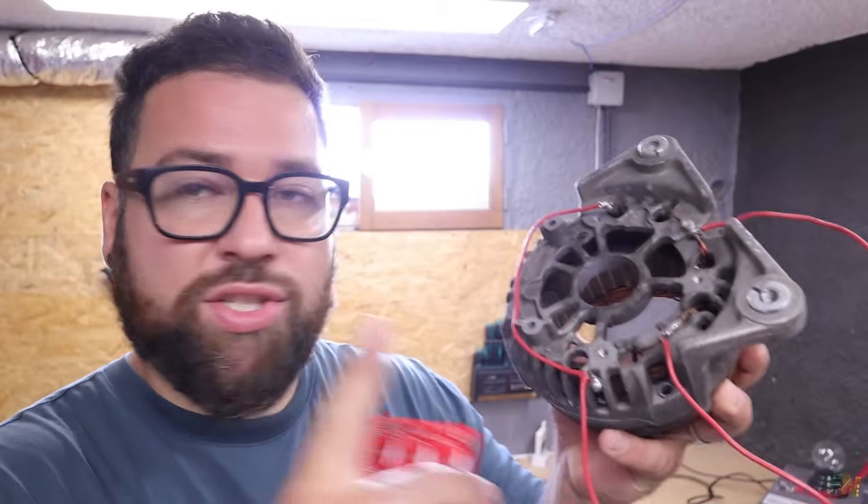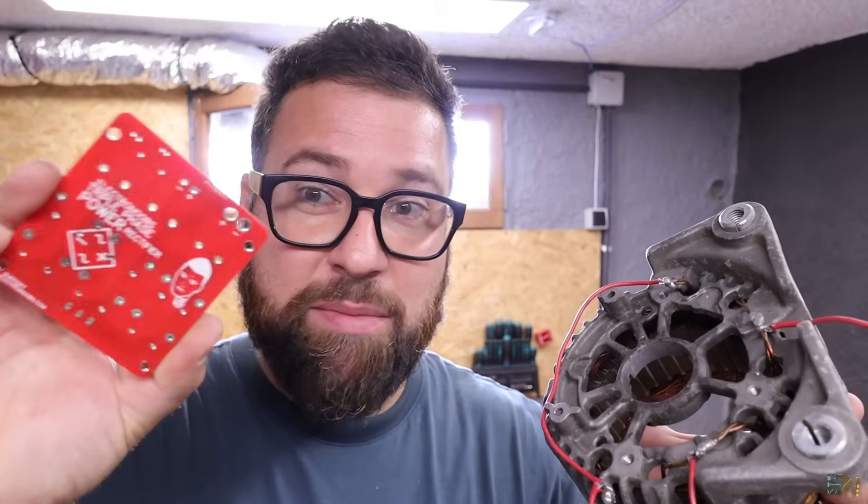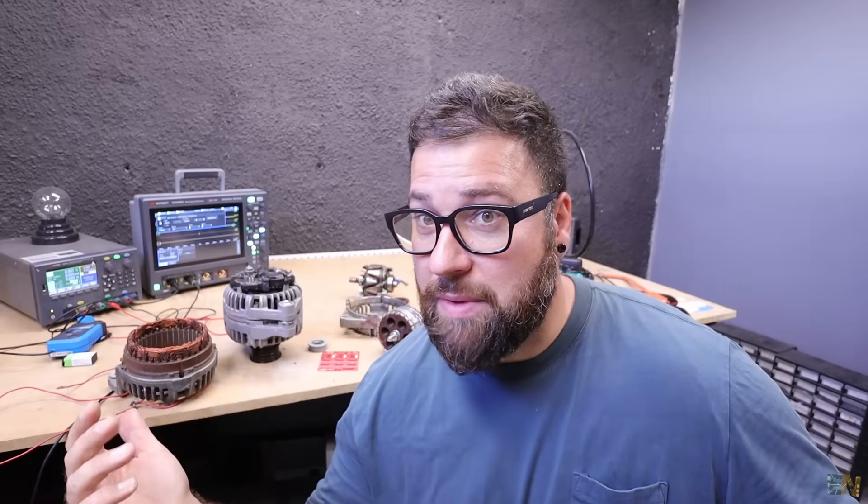But let's say that in a perfect world we could generate 3000 watts using this — how could you actually measure that? Because it's not that easy. I know that it's voltage times current, but it's not easy to measure without special equipment, especially when working with hundreds of amps. Also, the output of such a generator is triple phase. I made a small but quite powerful PCB for that. Let's see how much power we could measure — maybe 100 watts, 200, 500, or even 1000? Let's get started.